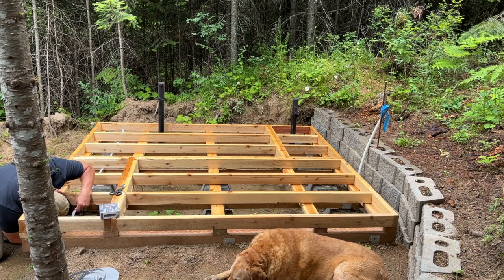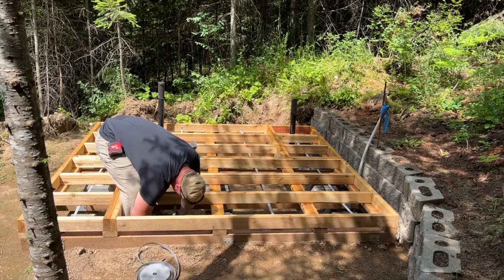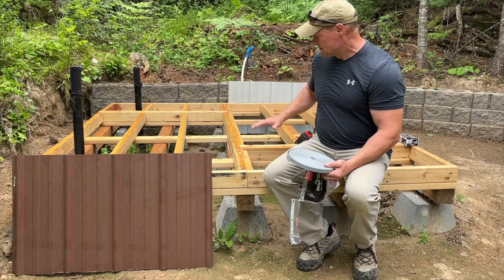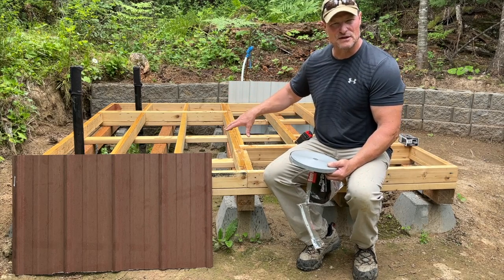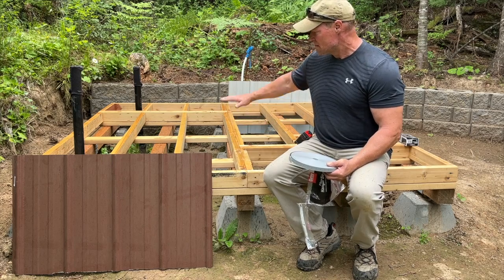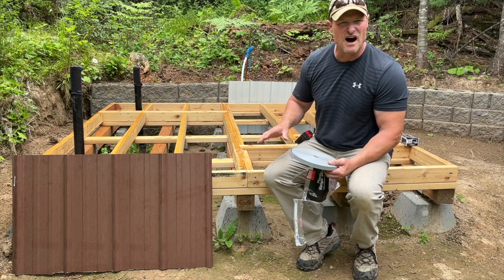I am not gonna have an underbelly on this, but I am gonna lay contractor plastic on the ground like you see typically in crawl spaces under homes. I've got some heavy thickness mill. I wanna do all this in one day, lay the plastic in here this way and then this way around the cement pillars, just to kind of give me a vapor barrier at ground level underneath the cabin before I seal this off by putting my insulation and flooring on top and then putting my metal along the edges to seal this entire area off from critters.